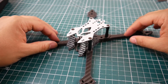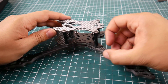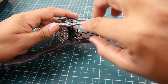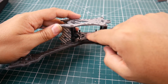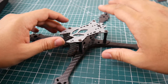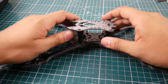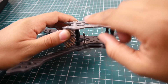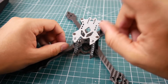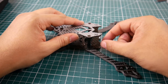The amount of space inside is 27 millimeters, so keep in mind you need space for your battery strap. Fitting flight controllers depending on size might be a little tricky — as you can see, it's pretty close to the standoff here, so take that into consideration. This frame is a bit of a blessing and a curse at the same time. Check the camera plates here.